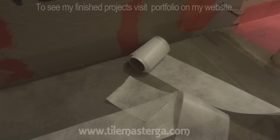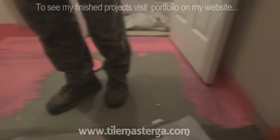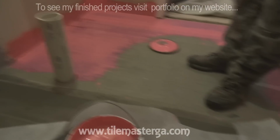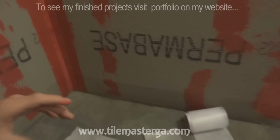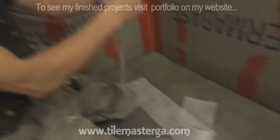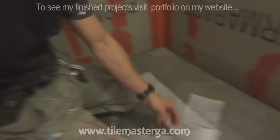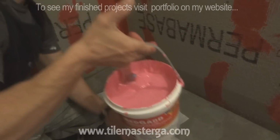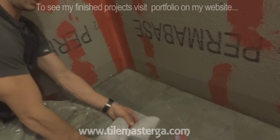Alright, we're getting to the shower. I already did a little bit over there. I'm working my way out still. I'll work on the main part later. But now I'm starting with the shower. So, of course, fiberglass mesh tape is a must. And membrane. You can use Red Guard, you can use a similar product to do so.